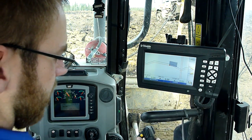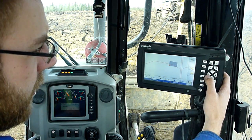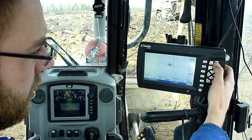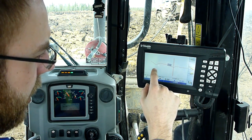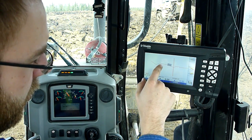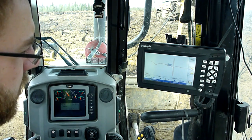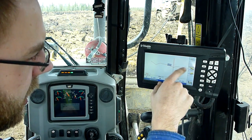Let's go back into regular mode here. We've got a single line and that's our design. You can see I've got a slope, a ditch. This is the road top — it's actually superelevated right now because we're in a corner. Then this gray square is my blade, and then another ditch.